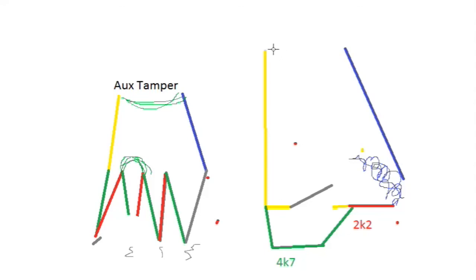Okay. Again, this is going to be a lot easier to describe when we're looking at the circuits and when we're looking at a few of the contacts. But essentially all you need to remember is your alarm resistor needs to go over your reed switch, and your secure resistor needs to go just connecting between the alarm, between the tamper, basically. And then obviously it's going to go through the path of less resistance to make sure that when you do your cabling, it's not frayed. So obviously make sure that this blue isn't actually connected to here, and you're missing out the 2K2, because obviously then you'll only be seeing the 4K7 or a closed circuit, which you don't want because it's not single pole.